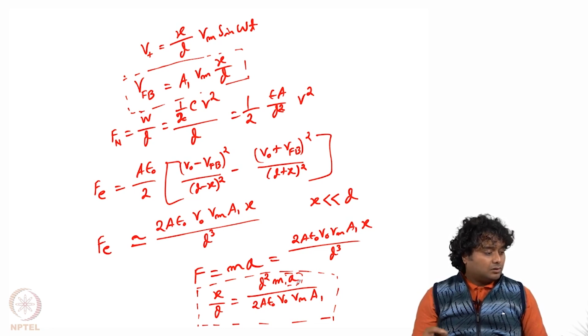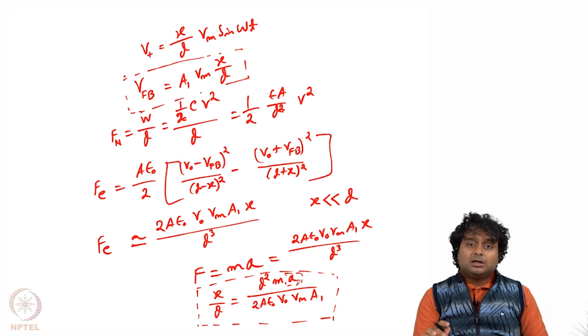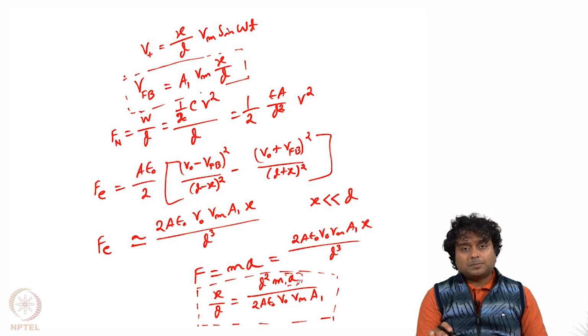Right. Then we have also discussed coupled electromechanics, and there we have seen how on a body both the electrostatic force and elastic force are applied together, how they act together, how the deflection changes with different voltages, and what pull-in voltage and stiction are, and how this kind of cantilevers or membranes are made. We have learnt about silicon etching, then also some material deposition in a very short way.